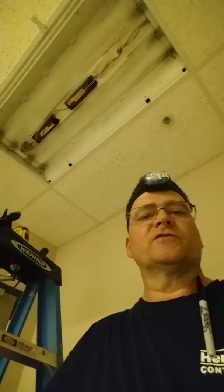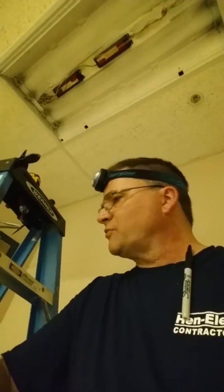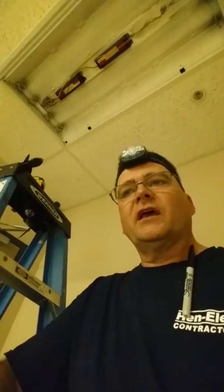How you doing? Today we're going to be putting in an LED fluorescent tube that is going to have voltage placed right on the connectors or the tombstones. So what we're going to do is retrofit the old lighting fixture, which was a 4-lamp T12 lighting fixture with 2 ballasts, 277 volts. It was a big energy waste, approximately 160 watts. And we're going to replace that with 2 Philips LED bulbs.